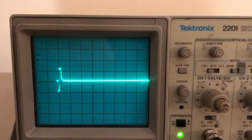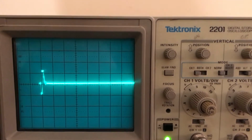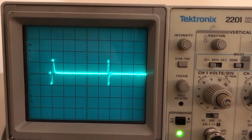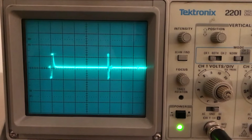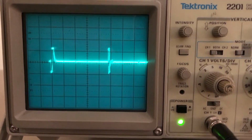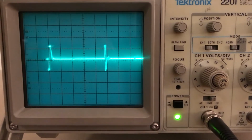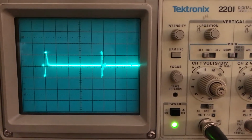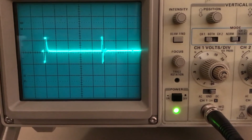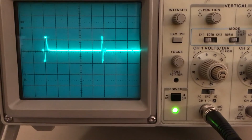Okay, so if I take the probe off the sample, you just see the incoming pulse. It's not being rebounded by the bottom of our sample. When I press this onto the sample, now you can see the sound wave peak as it's returning to the transducer. Okay, so that looks like it's just under 5 squares in time. So I'll have to look and see what our time setting is so that we can figure out what the actual travel time is corresponding to those 5 squares.